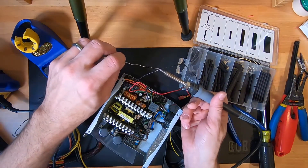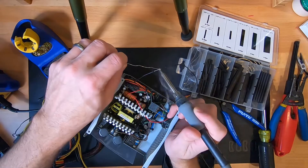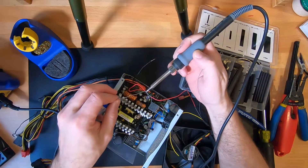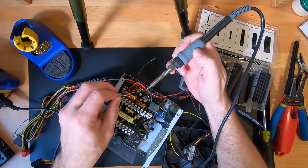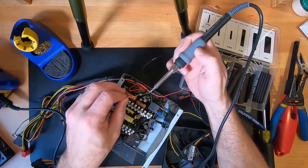I'm going to apply the heat of the soldering iron underneath the wire, and once that heats up, the solder will flow down and cover up both wires. I'll do the same thing with the red wire. You do want to be careful not to burn the sheathing on the wire itself, so sometimes you may need to start the solder by touching the tip of the soldering iron to get it flowing.